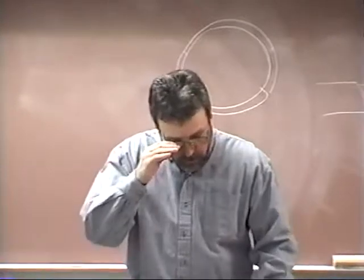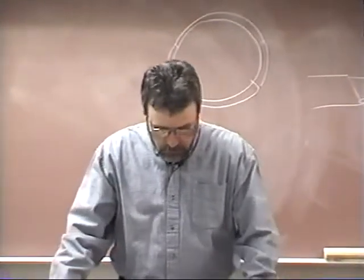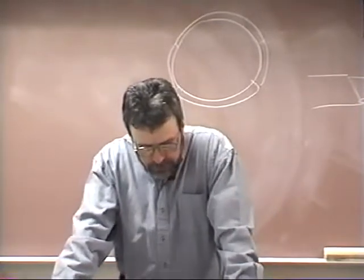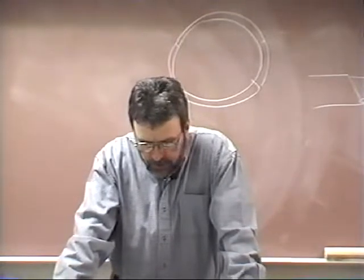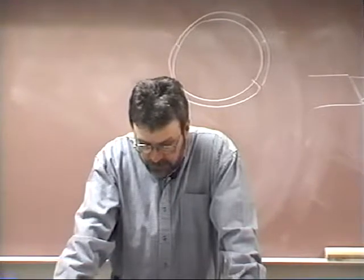Okay, page 124 talks about poor fit up. Read that. Pipe axis at 45 degree, aka 6G position. Let's read page 125. Underneath the photographs, it says intermediate beads are deposited in a slightly different manner than in the case where the pipes are in the 5G position.